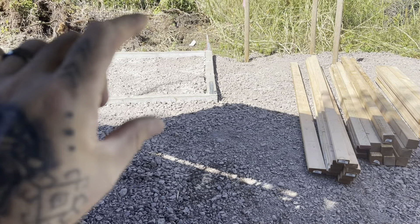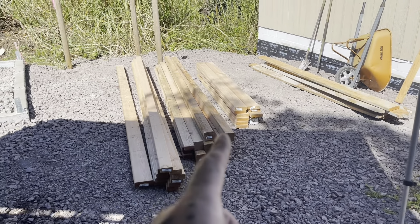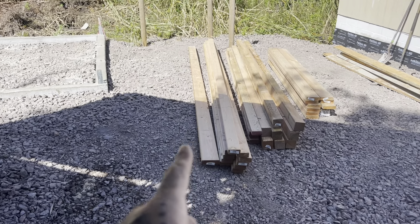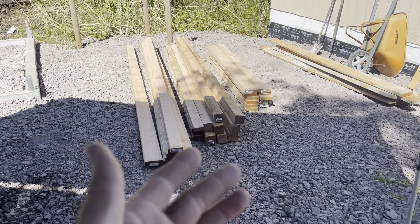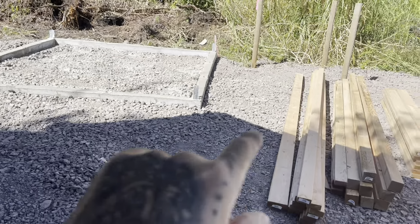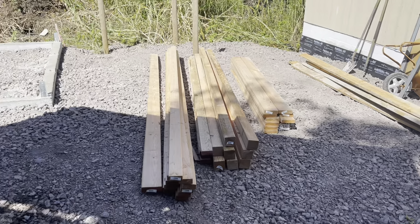Then there's a piece for the inside upper corner. I got regular chicken wire for the top, and the bottom three feet will be 14-gauge half-inch by one-inch galvanized mesh fencing. The wood I got: four by fours for the vertical pieces and the top cap all the way around. The 16-foot two by fours are my purlins, that 16-foot two by six is my ridge beam — I wanted a two by eight but they didn't have them in 16-foot. Twelve-foot two by fours are for cross supports halfway up between the four by fours, and the two by sixes are for all my roof rafters.